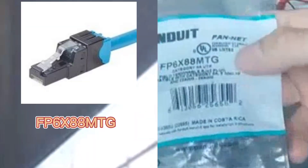Something new and interesting that has been introduced to the industry is what we call a field termination plug. This looks like a hybrid between a jack and a modular plug. The benefit is that you can now make direct connections — terminating the cable into this field termination plug and plugging it directly into your access point, camera, or any IoT device. It's certified to the standard and comes with a system warranty of between 15 to 25 years.